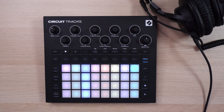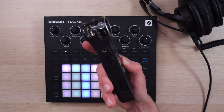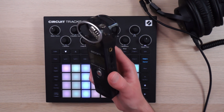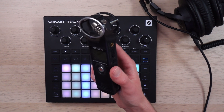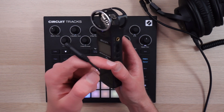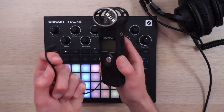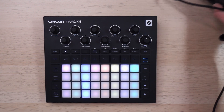If you're maybe a bit younger or in a harder financial spot, the circuit might have already been a bit of a stretch to purchase. I'm well aware that not everyone can just spring for fancy recording setups or even fancier groove boxes, so you can absolutely make this work. Just this first method — it's pretty easy to set up. And if you want to go even more portable, you can get something like a cheap handy recorder. This is the original Zoom H1, and it has a mic input slash line input on the side. I think it's mostly just a mic input, so you'll probably want to get some sort of cheap attenuator cable, plug this into here, plug the circuit into the other end, and that will reduce the volume of the incoming signal so that you can listen to it loudly but not have it clip. But that is the first method.